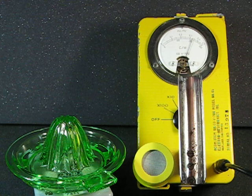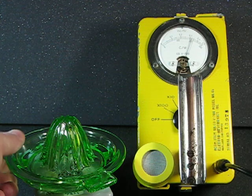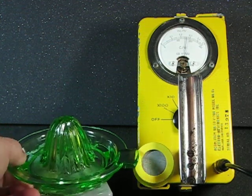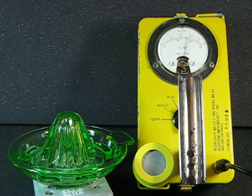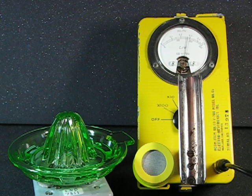Give or take. And if you're using an SBM20-based tube, those are about half as sensitive for the beta, which is primarily what we're seeing here. So you'll probably get about half as many counts per minute on an SBM20 tube — and that's only if it's unshielded, so if it does not have the energy compensation wrapping around it, or the beta shield basically.